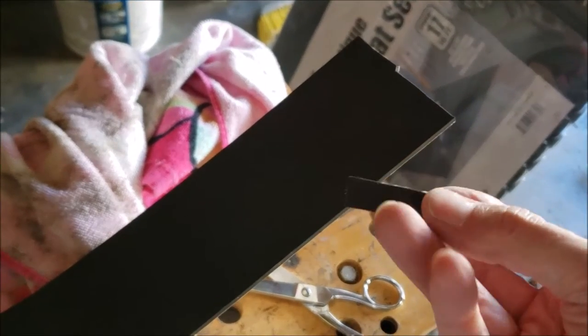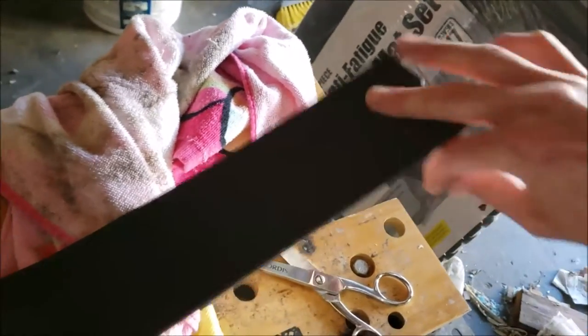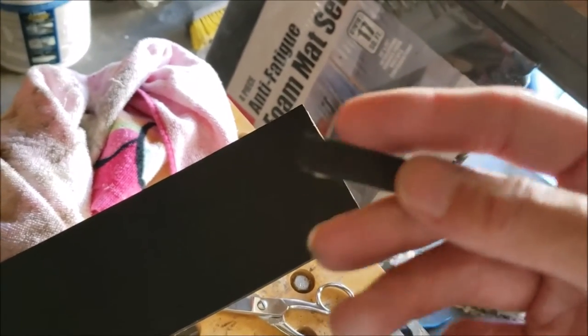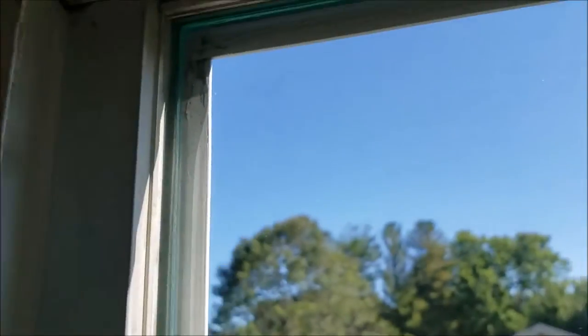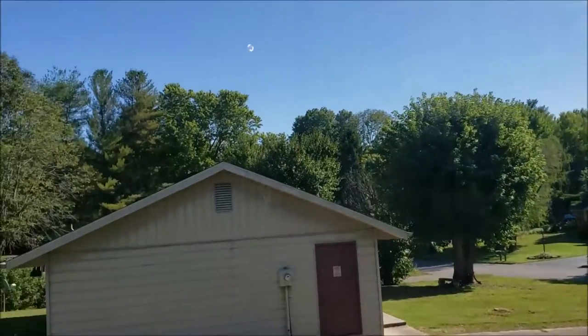I needed a little rubber pad to support and center the glass. I didn't have the original material, but I found some dense rubber foot pads like you find on lawn mowers — that'll do the same job. Always do a dry run first: I've got the glass in without sealant, checking the rubber spacers. Everything looks good — spacing is good all the way around. Now I'll pull it out carefully and put a bead of sealant in.